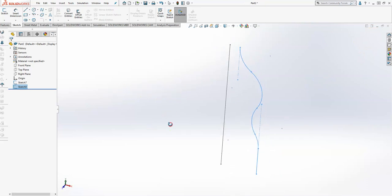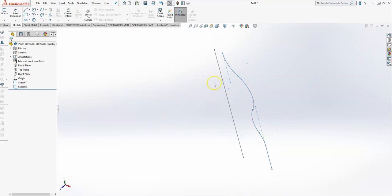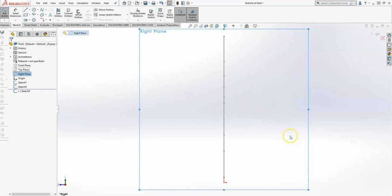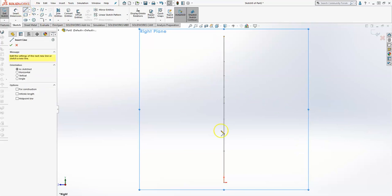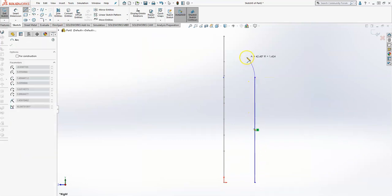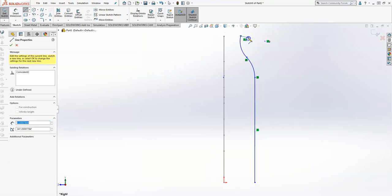Now if you were to look at this, you can see that both these sketches are on the same plane, but now I need 90 degrees to this plane, so I'm going to pick the right plane and create a sketch on it, and that shifts everything over. This sketch is simply a vertical line and two arcs, so I'll go ahead and come out here a ways, give myself a nice vertical line, one arc and two arcs, and I'm finished with that.